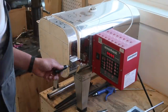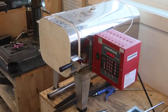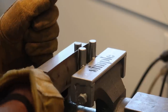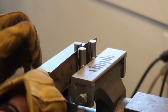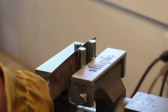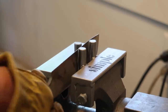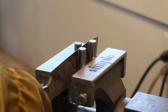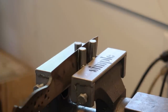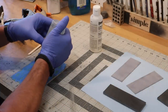We've let it come up to room temperature — that took a couple of hours; I usually leave it like three hours or something. You want to make sure it's warmed up, and then we can go ahead and do our two temper cycles. Now I ended up developing quite a warp while I was tempering, and I ended up having to go back and use my little blade straightening tool. Very carefully pull that warp out. Thanks so much to you guys for your suggestions — I ended up doing this right out of the temper cycle, so the blade was at 400 degrees, and it definitely made a difference. I got that warp right out and I didn't break the knife. Bonus.